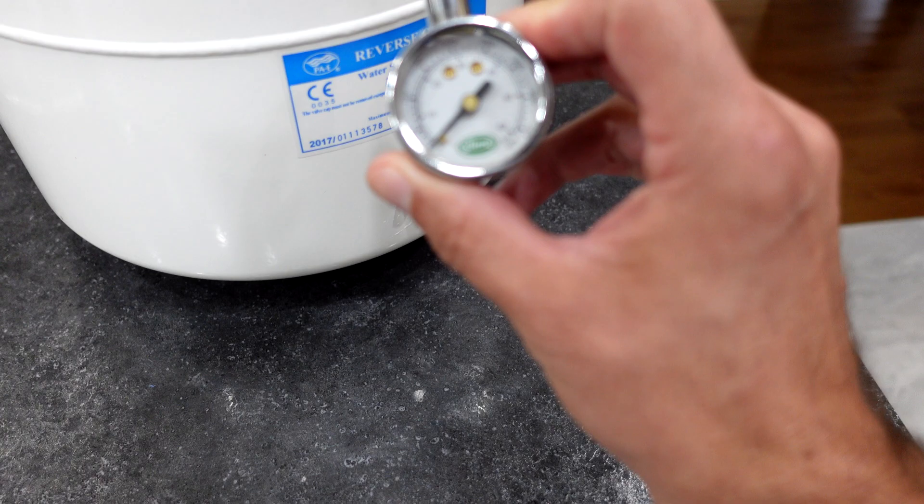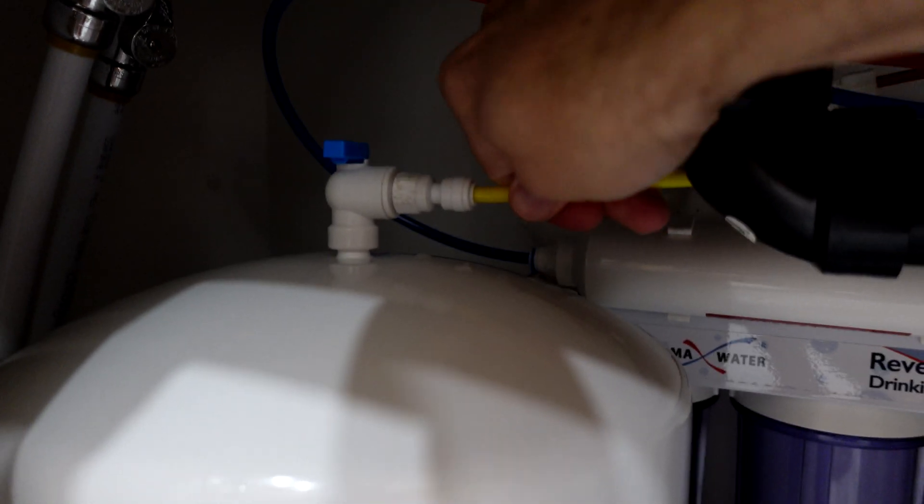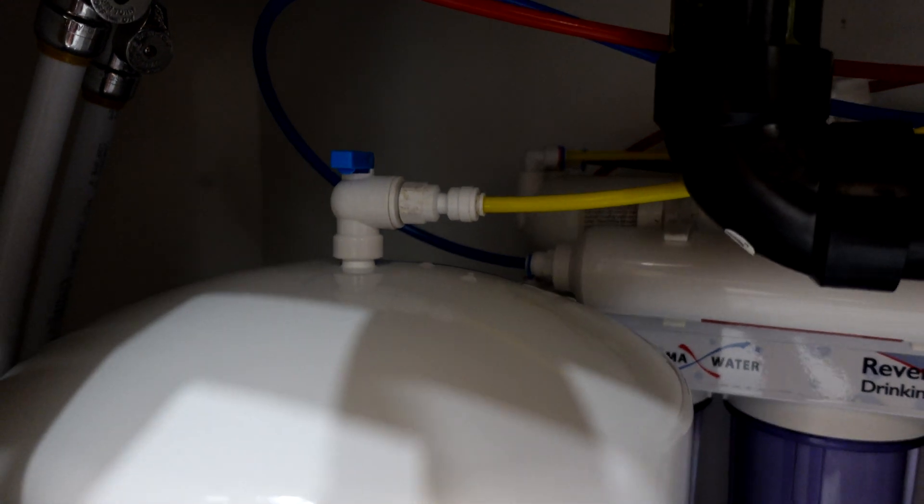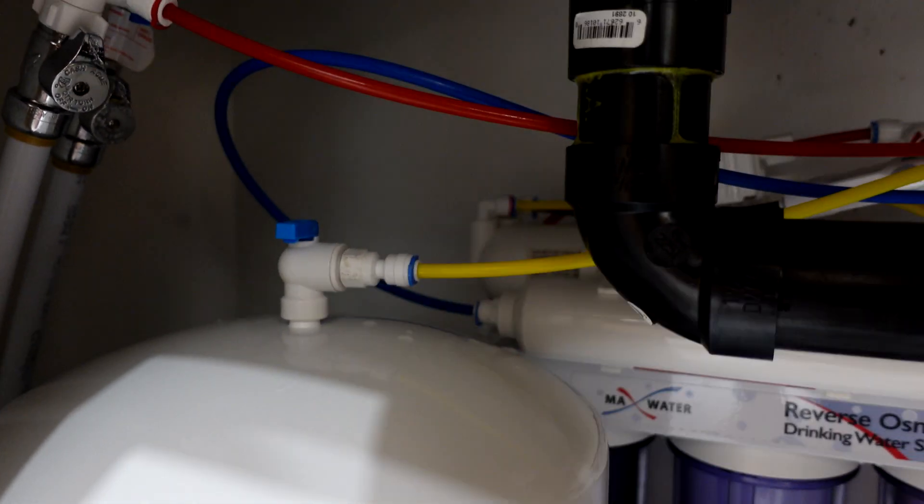This gauge will show that, but just barely. Once your tank is filled back up to 6 PSI, we're going to close that top valve again. We're going to put it back underneath the sink, reconnect everything, and let the RO fill up that reservoir. To connect things back up, it is super easy — just point it in and give it a firm push to make sure it's seated all the way. Once it is, put that blue clip back in its place.